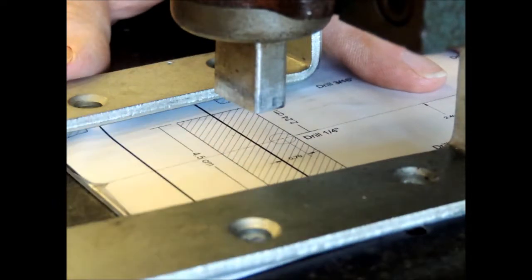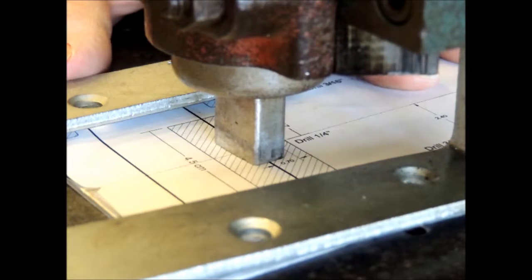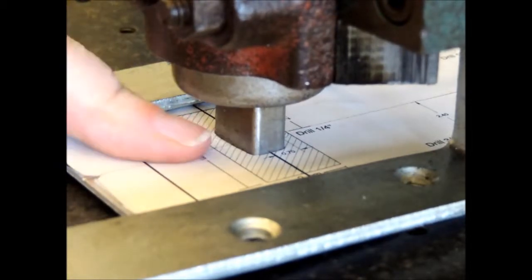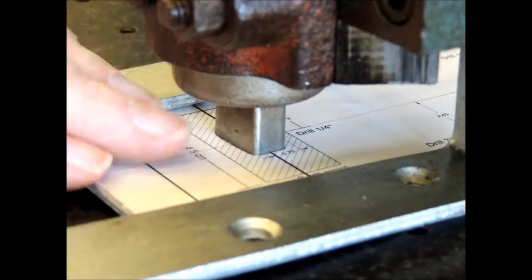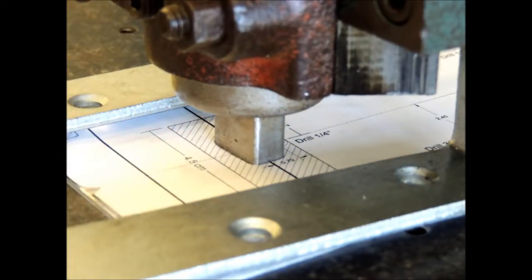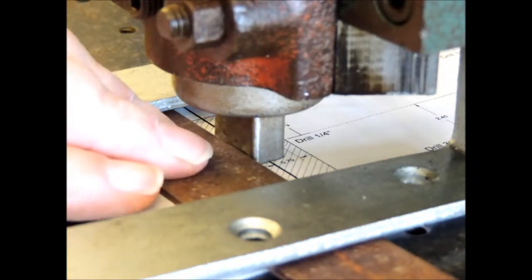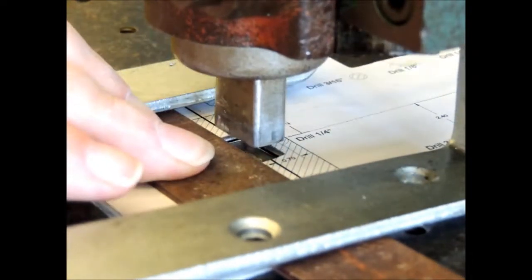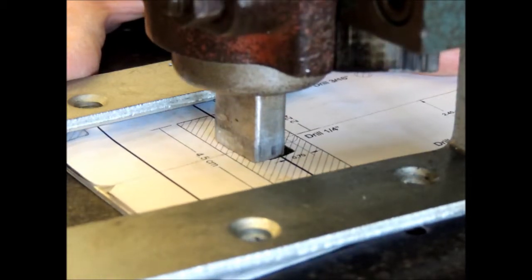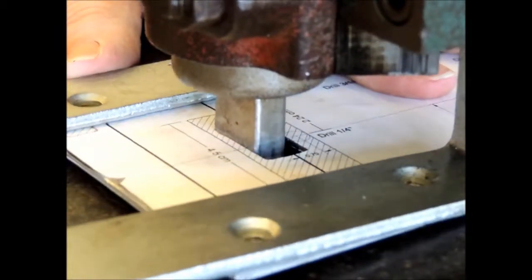For the center, I'm going to come down right in the middle. It has no trouble punching in the middle — it's just that when you try to bring it back up, you're going to have so much force that your aluminum is going to bend. So I take a steel ruler and slide it underneath there. Remember to watch your fingers — that should help keep it a little straighter. Then you can come over and start nibbling a little bit more. After the first one, it doesn't stick so bad anymore.